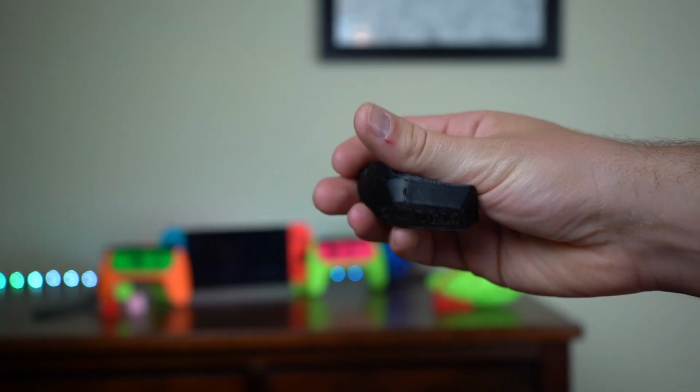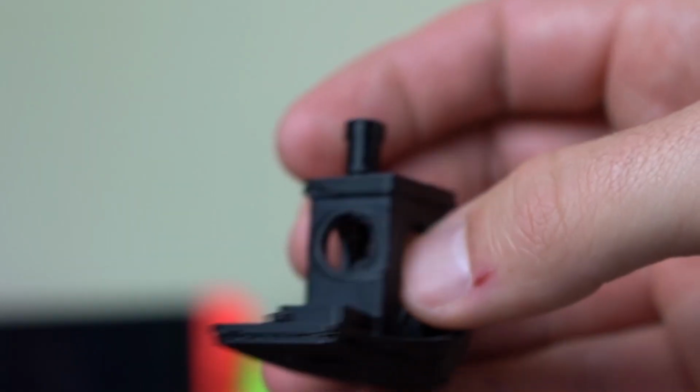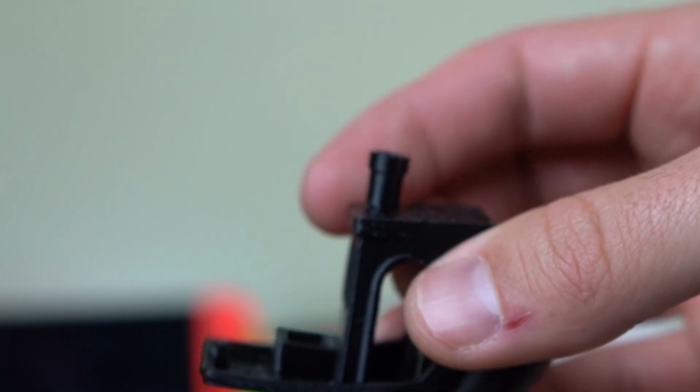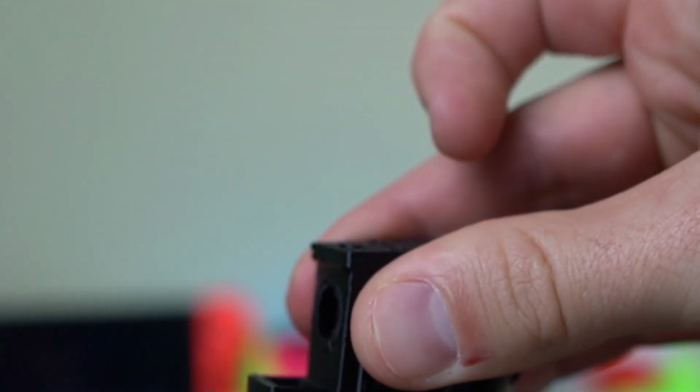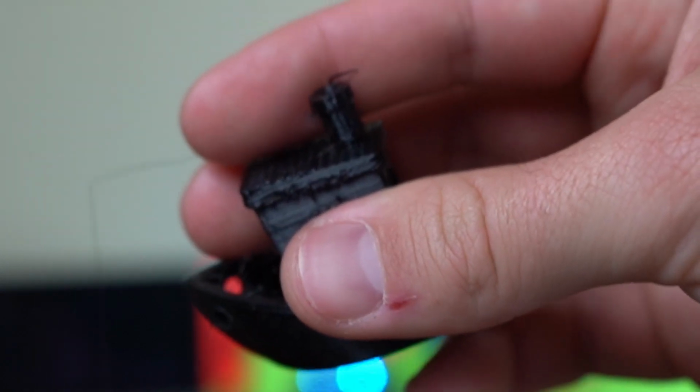The second consistent issue I've had is along the base of the smokestack, where all prints have either failed, or began to fail, before eventually recovering while having no structural integrity at all. Solutions I have tried are more cooling, less cooling, more heat, less heat, changing the layer time in order to allow the print to cool a bit before the nozzle returns to heat it up. I thought that last one would work. Maybe my setting was still not low enough or long enough because nothing changed the result.